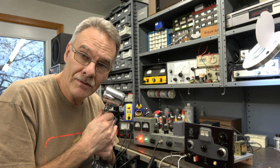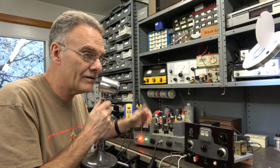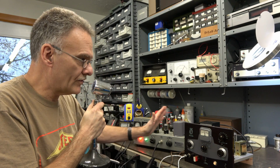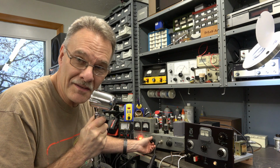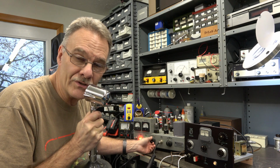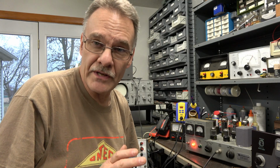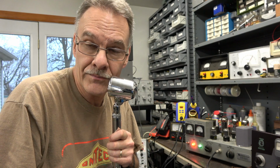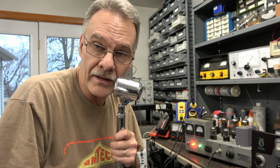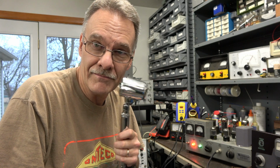That's the audio. A little bit of buzz you're hearing is probably the proximity of the radio to the microphone, picking up a little bit of AC, but whoa, see, I can really crank her up, make it happen. But as you can see, it's got pretty decent audio. So I tweaked the receiver a little bit, so we got a little bit clearer audio now. This is a non-powered 10DA type of element. Sounds pretty darn good. So what a great little transmitter, huh?